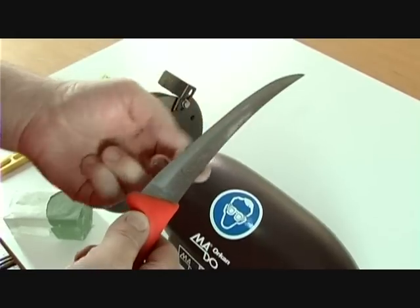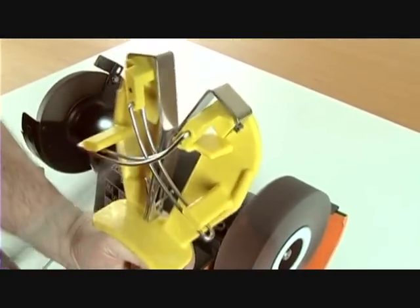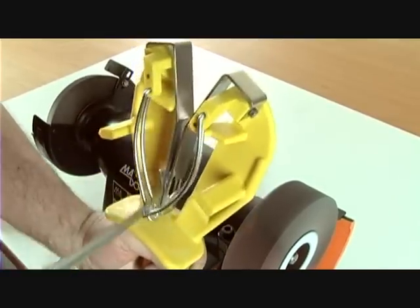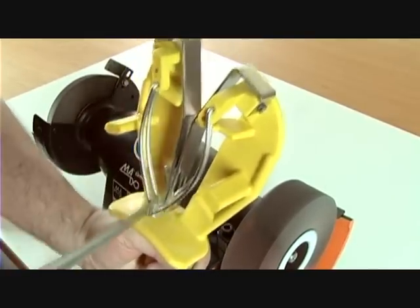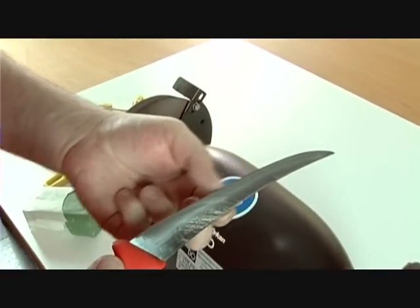In order to optimize the sharpness of the blade, a hand grinding tool or a polishing steel is used after the grinding cycles in order to finalize the edging to its proper setting. The blade will be sharpened perfectly after a few strokes.